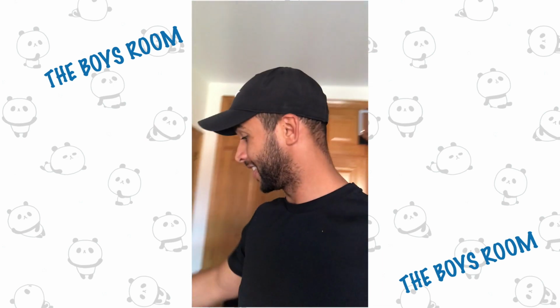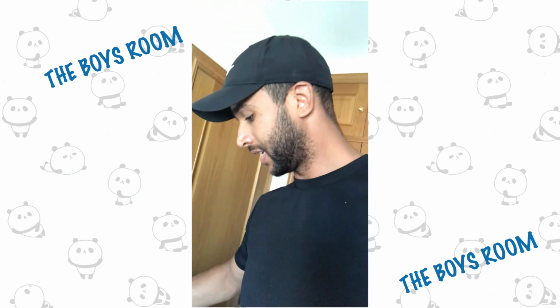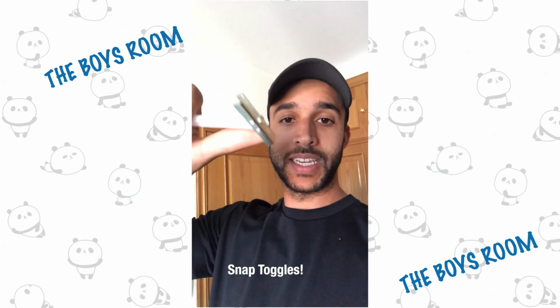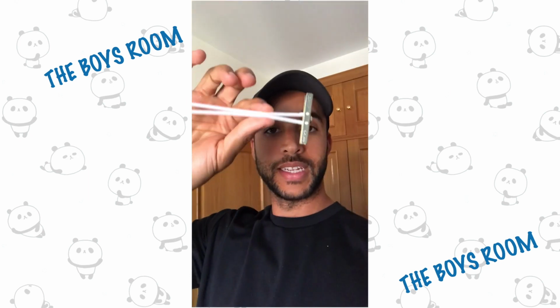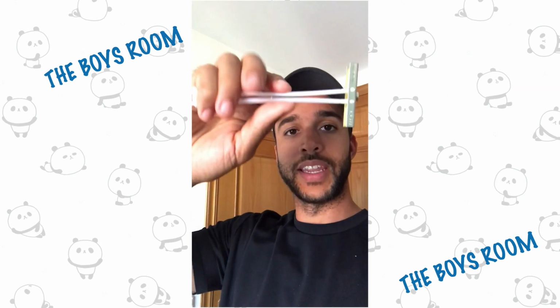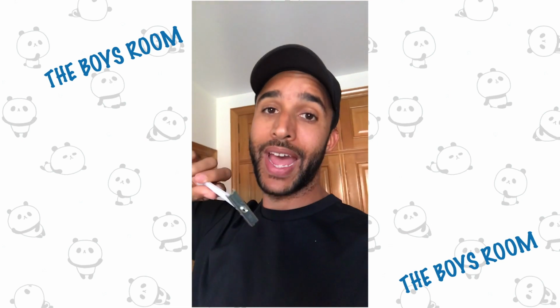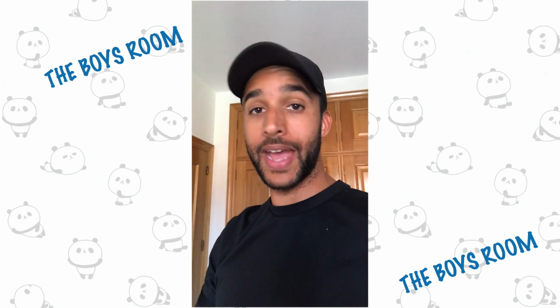So I finally got these in, these bad boys here, and these are snap toggles. Basically what they do is they go in the wall like this, and then bam, this comes up, you pull it tight, you move this thing all the way down, and then you snap off the rest. So it ends up looking like that. And the good thing about that is that they're reusable, so once you put it in, you can take the screw out and put it back in. It doesn't actually damage it because the screw goes into the metal piece in the back, which is fantastic.